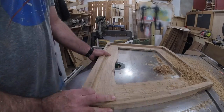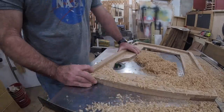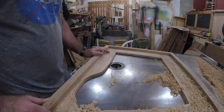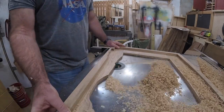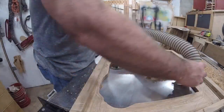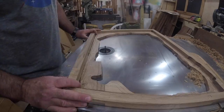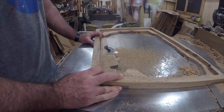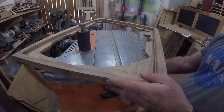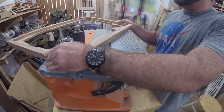Now that I've got a good fit, I need to cut out the shape of the puzzle on the front of the frame. Using the same template, I trace the shape of the puzzle, then freehand that same shape about a quarter of an inch smaller so the puzzle won't fall through. Using a fairly large straight bit in the router table, I hog out most of the waste inside my line. I don't try to get very close to the line, because this oak is pretty splintery and I don't want any tear-out to ruin my final shape. Once I've got most of the waste out of the way, I change to a small spiral bit to take the shape down to the line, really taking my time with the small ins and outs. Then back over to the spindle sander for a pretty awkward sanding — large picture frames on small spindle sanders is less than ideal, but it got the job done.